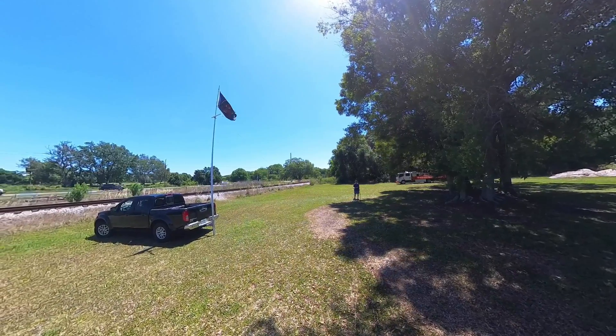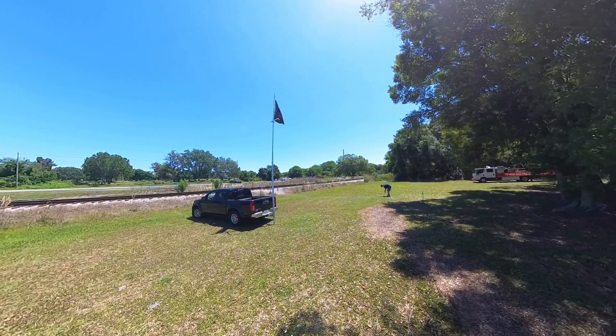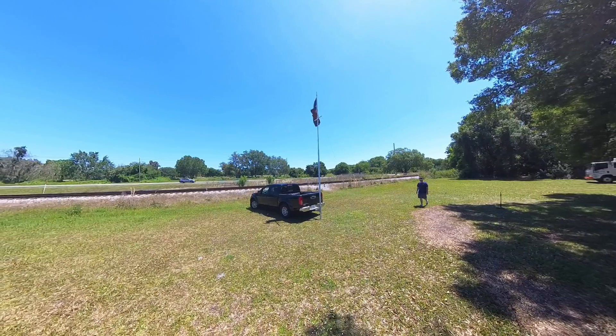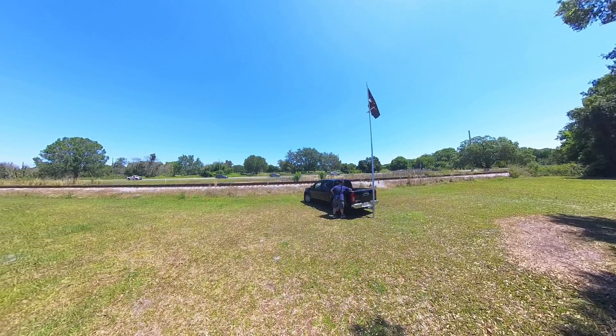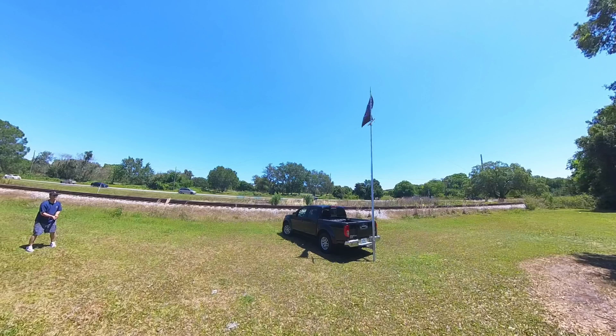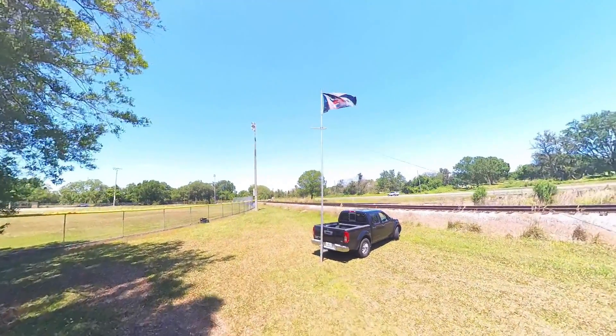I'm a pragmatist, so I'm going to achieve the best possible configuration I can and then operate and do some testing — that's how you should look at amateur radio communication. One thing to note: throughout all of these videos I use a 360 camera, and depending on where an object is on the two side extremes it gets distorted. So just understand things will seem to bend and twist in ways that aren't humanly possible — I use this to achieve the broadest field of view and do some unique things in post edit. See that post that just showed up on the left side? Trust me, it's straight as can be. I'm moving to the left extreme, grabbed the other end of the 73-foot wire, and now going to the far opposite end putting a ground stake in — this gives you the footprint of what it looks like to install this inverted V.